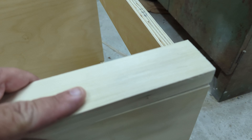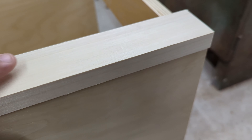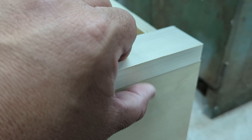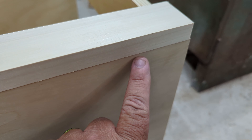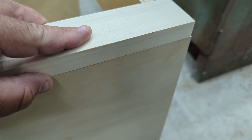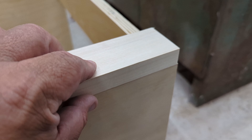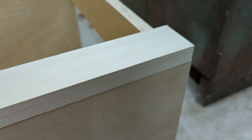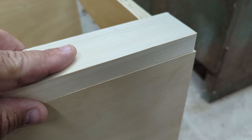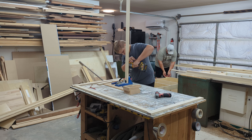Really quickly, I want to take a second on the face frame. When you get ready to do this, you're better off allowing your edge to have a little bit of an overhang — just a smidge. You would much rather have that clean shadow line than accidentally make it a little too narrow and have the edge of the plywood showing. Even if you want it perfectly smooth, you can go over it with a flush trim bit on a router and it will clean up perfectly. But if you go inside just a smidge, it will never look right.